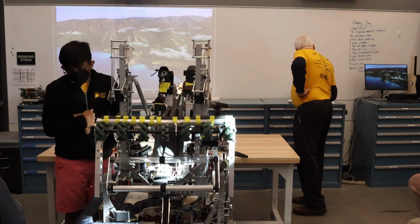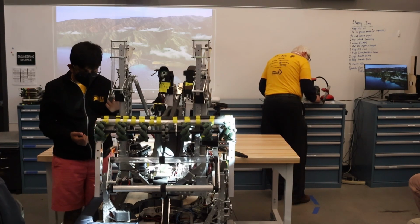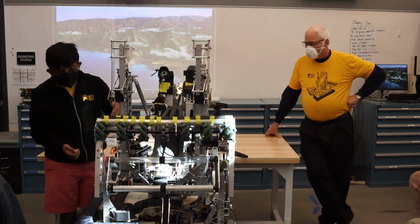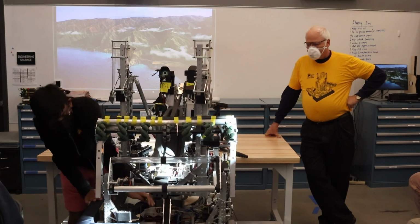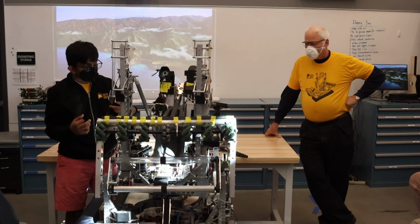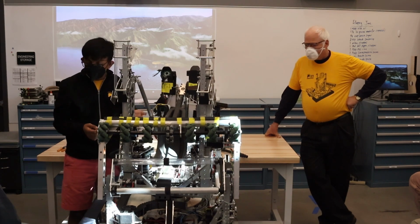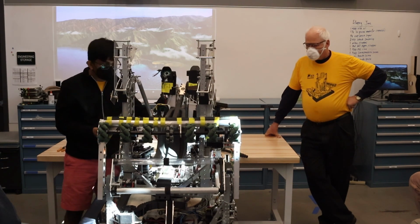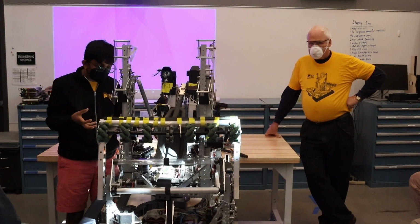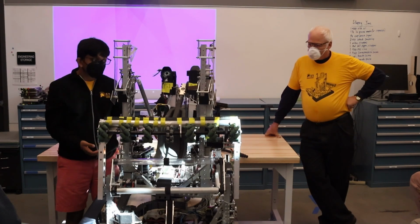And we put a microcontroller on it, specifically the Raspberry Pi Pico, so that we could package info from our incremental drivetrain encoders and the IMU itself and send that out over SPI to a Raspberry Pi, which is right here. The Raspberry Pi has a custom power board on top, which allows it to just take raw power from the PD board using ferrule connectors, kind of like the CAN connectors in the Rio. And what that allows us to do is just plug in power from anywhere and not have to worry about getting supplied power from the VRM.